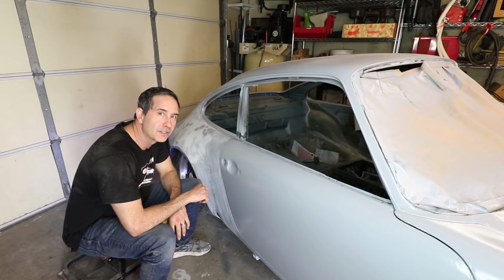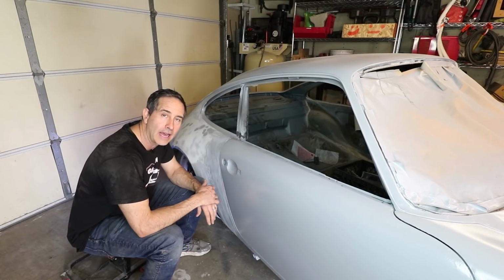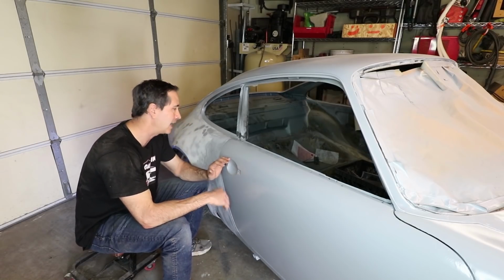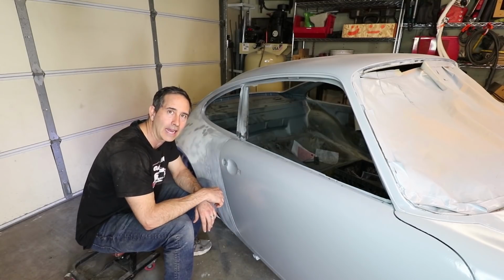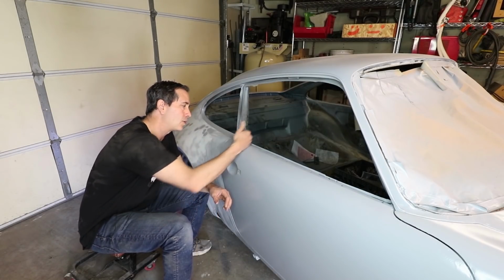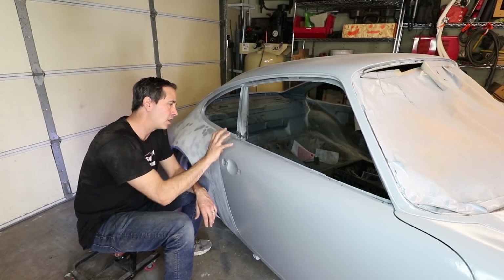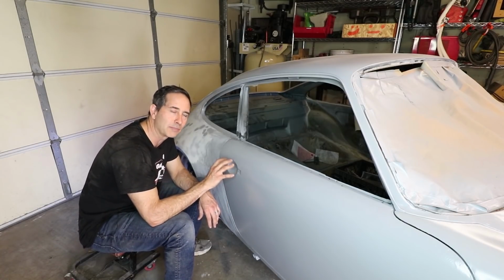Okay, my advice to you if you're doing this procedure of adjusting the doors and the latches, now that the rubber's in place, is to put the latch in last. And I don't use the latch to adjust anything. It's only there to keep the door closed. I mean, that's why they call it a latch. It's not really there to adjust body gaps. It does control the pressure that the seal is under, so this distance has to be correct. And of course, it shouldn't alter the position of the door. But the door is really held in place by the hinges.